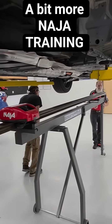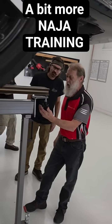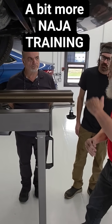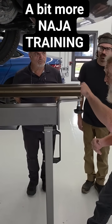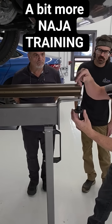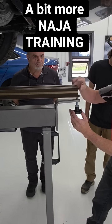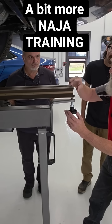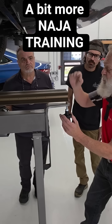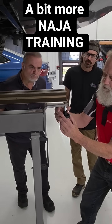We have a lot of flow here — this is important. Down here, we have to get support this far. We don't want to lift it; we want it to remain where it is — it's in a neutral point right now. All I want to do is bring this dial up and take the air gap out. You can feel it getting solid — it's vibrating a little bit and it'll get solid. Then just put the lock nut up and hold it there. That's all you have to do.